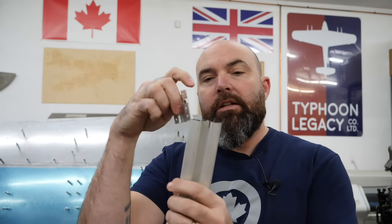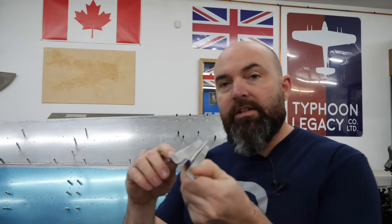That's the connection on the back side of frame A — no connection on the forward side. One thing we found with these little members, and in a lot of other Hawker structural design areas, is minimum edge distance everywhere. The problem with minimum edge distance is that if you ever have to repair it, you've immediately gone beyond your limits. We found that the original cleats for the stringers almost all had blown edge distance on them. I've put a little lip on ours — hopefully you can see that — which just brings it back up and nests neatly, both feet nesting neatly into that stringer. This prevents any blowing out of the edge distance on these cleats. And if you ever have to repair it, go oversized on a fastener, we'll be able to do it without causing any issues with limits.